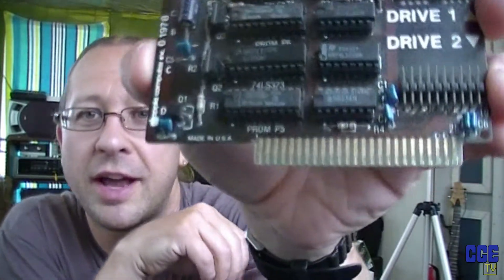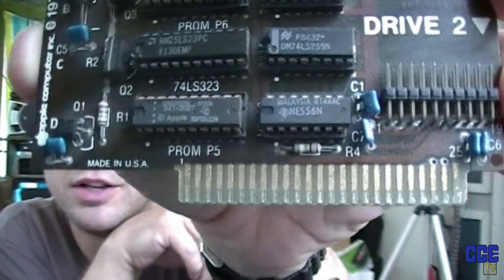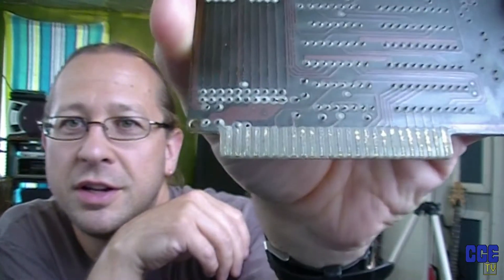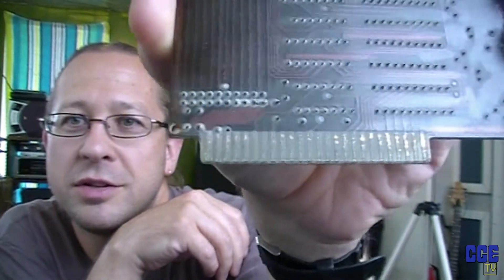If you take a look at it, look at those pins — they look like shit. And the other side is even worse. It's all green and corroded. But on the ad, he said that it was all worn out. When I looked at the pictures closer, I knew it wasn't wear and tear. Usually wear and tear turns gold-silver; it doesn't turn it green. These are supposed to be gold-plated and gold does not corrode.